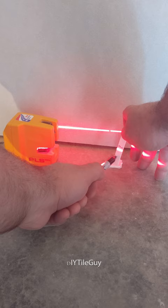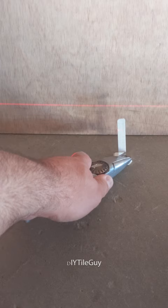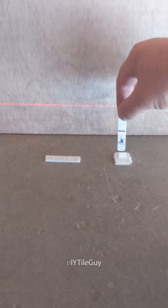This side here is down. Now for another section of the floor, I'm going to take my marker, match it up with the laser line, and then cut this off. You line it up with the new line — and there it goes. I'm actually just a hair low, but that's the idea. You can see this one has a little bit of a stub on it, meaning it's higher than our high point, so this area will have to come up to here and the high point will just barely cover the other one.